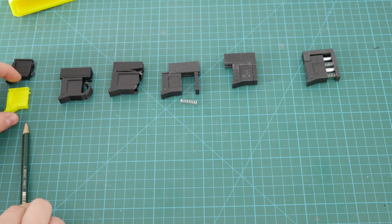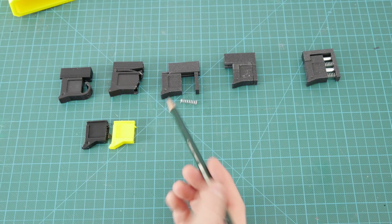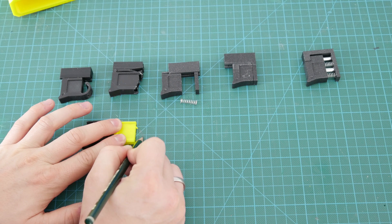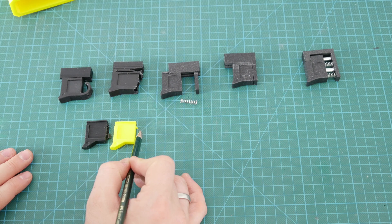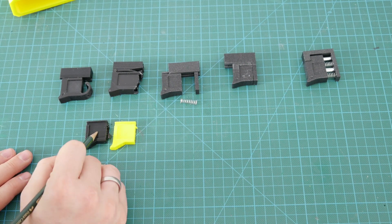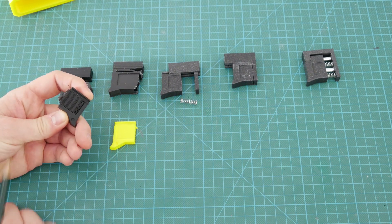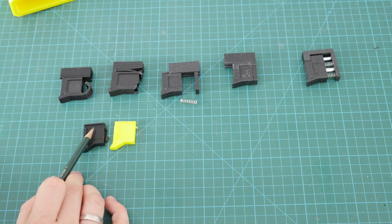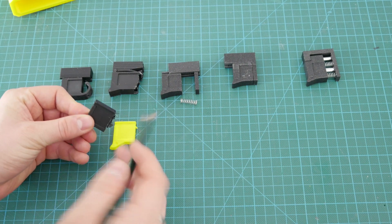The original files had these two designs right here. This is the trigger — it's very slim. On the back side it has a small spring-like design. The issue is the spring instantly broke off with the first pulling of the trigger. This broke off in CPE and in PLA material. I couldn't even release the support material — it broke off instantly. The files were also missing the top piece where the slide mechanism actually works in.